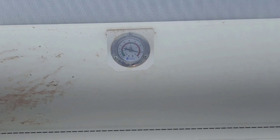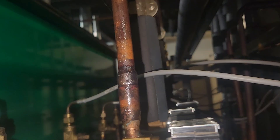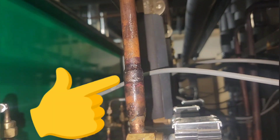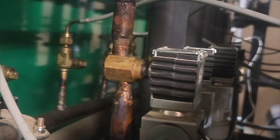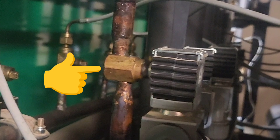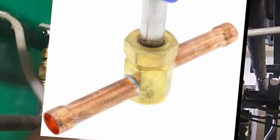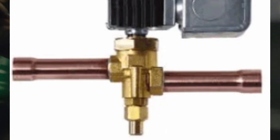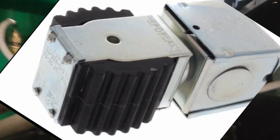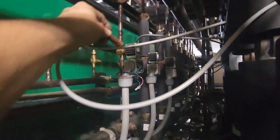There was a second restriction upstream at the solenoid valve. I only wonder why it wasn't sweating before I replaced the dryer, because I should have seen this if it was happening earlier. This is one of the most basic solenoid valves — it does not have a manual lift. It's also half-inch, which I did not have on my truck, and it uses an MKC1 coil, which I didn't have either. The closest I had was a 5/8" solenoid valve with a manual stem, and I also had the dual-voltage MKC2 coil that it required, which I wired up as 120 volt.